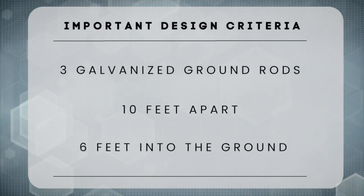Electric fencing, just as a reminder, is really a system. It includes both the wire — which is what most people see — the energizer, the charger that we're using to create the shock, and then the grounding system is another important component. The grounding system is essentially the antenna for that whole fence, that allows the charge going out on that wire to circulate back to the energizer or the controller of the system.